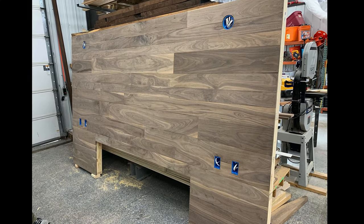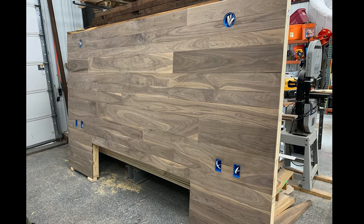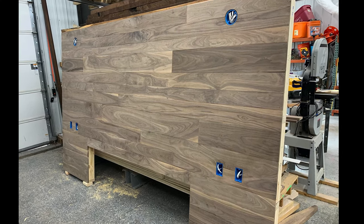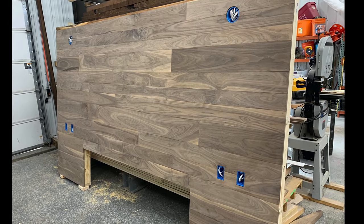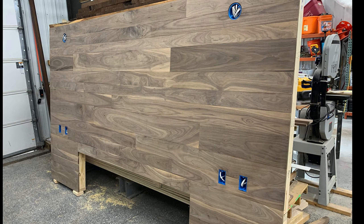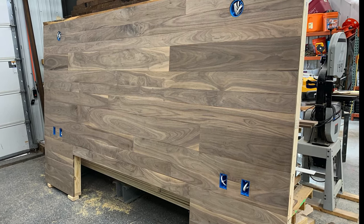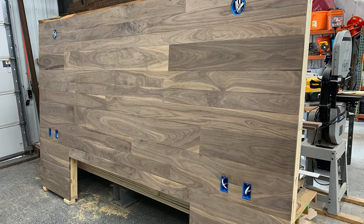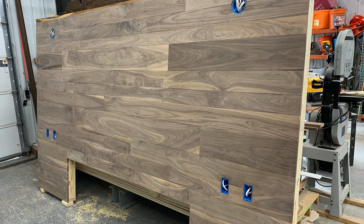That's before finish, but you can see the electrical that we roughed in there, kind of roughed in like it's a normal wall. I'm really sorry I don't have more pictures along the way — I wasn't planning on making a video out of this, but I thought it was such a cool build in hindsight. You'll notice the edges are just exposed 2x4. Those will get wrapped with 1x, but not until after it's hung on the wall, because we hung it on the wall and then had cleats screwed to the wall that we screwed through that edge into. After everything was solid, we trimmed it out with 1x.